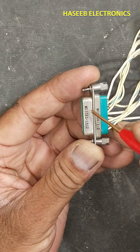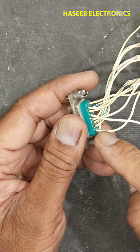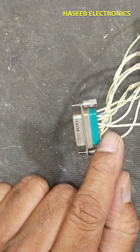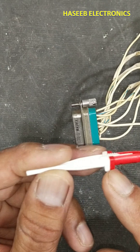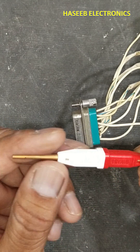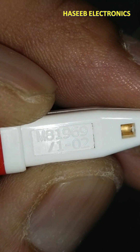Welcome back to my channel. When we have a D15 connector, it is not a soldering connector — it is a crimpable connector that uses size 20 contacts. Normally we use a plastic insertion and removal tool, but for this connector we need a metallic insertion and removal tool. Its part number is M81969.